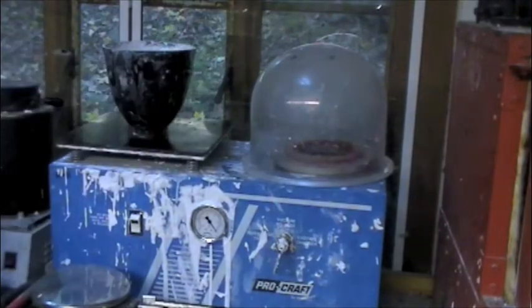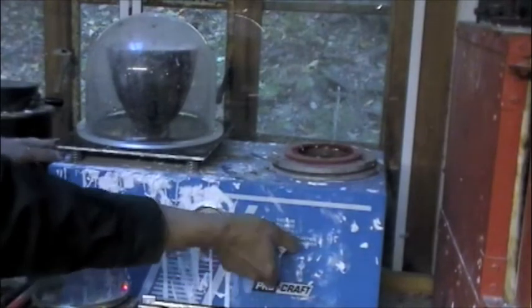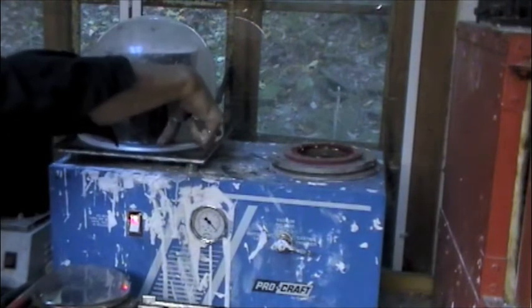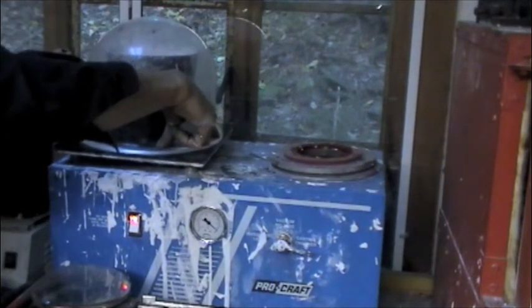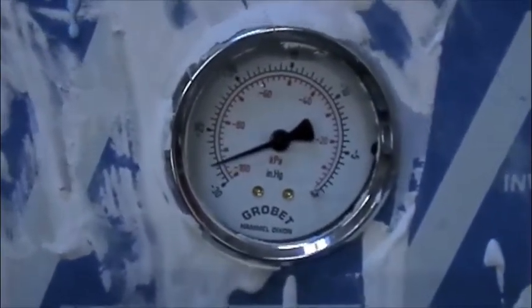Now when you mix stuff up like that, you entrap or entrain lots of air. We're going to vacuum that out. So we put the bowl in the dome, turn on the vacuum, and hold down the flanges for a good seal. Watch that little clunk — bam, there it goes. It's on its way to an almost complete vacuum, 27 inches of mercury. That stuff is going to start boiling. Meanwhile, I'm going to joggle the spring table to make sure all the bubbles rise — get all that air. Then we'll scoop the excess back into the bowl.